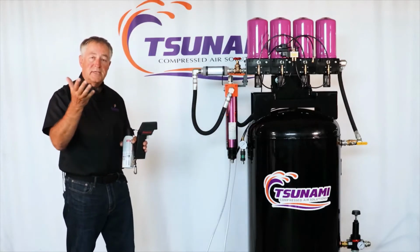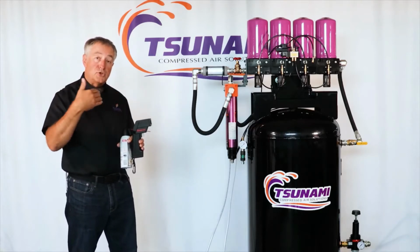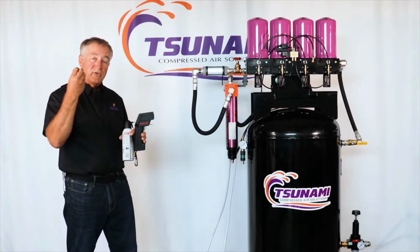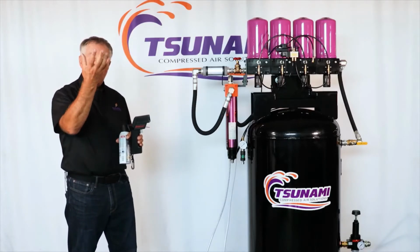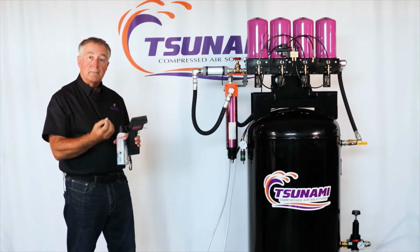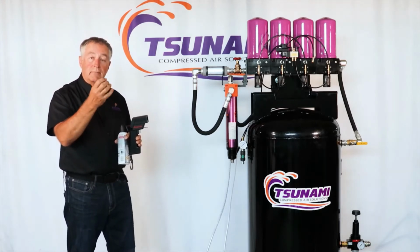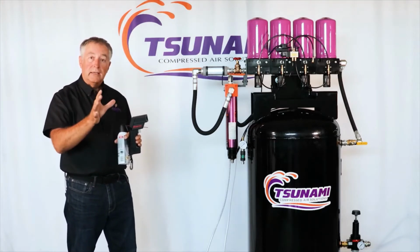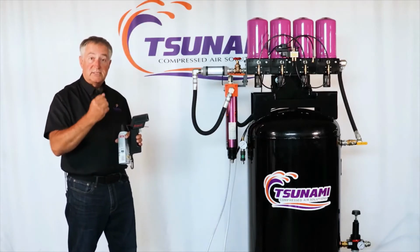And what happens is if you have compressed air that has humidity in it, like right now there's humidity in this room I'm in, but if it rapidly cooled, the air temperature is going to drop and that humidity is going to change to more of a fog or a liquid. And when that blows up either inside your socks or your filter bags or your cartridges, that creates a moist lining, and what happens is the caking that happens tends to stick.